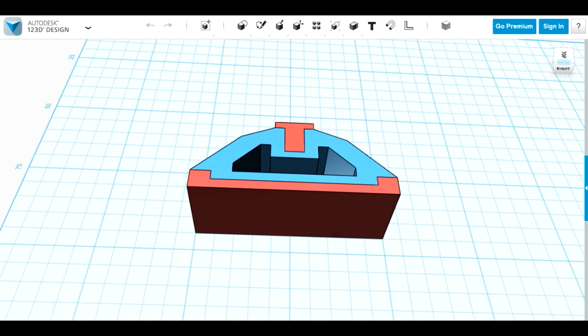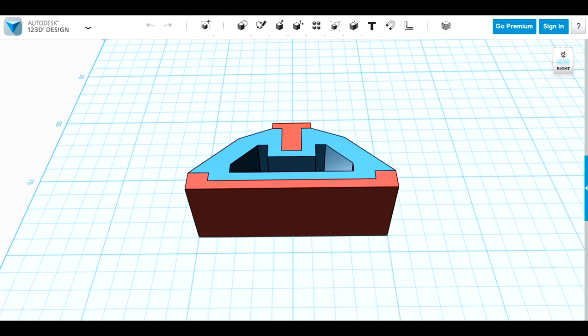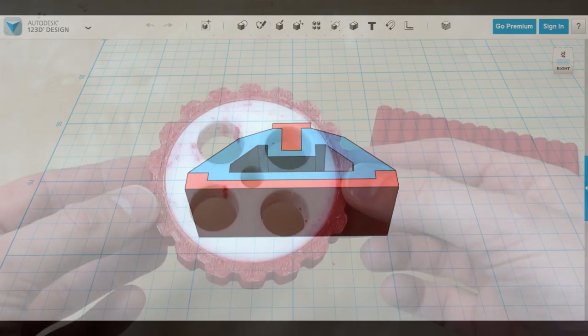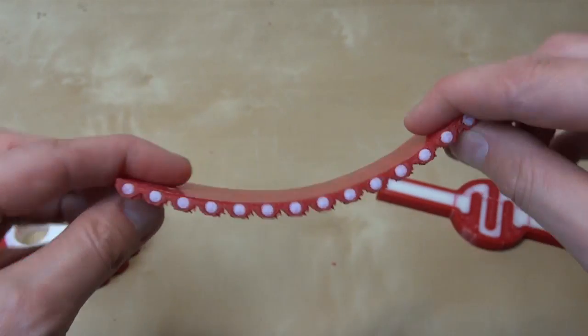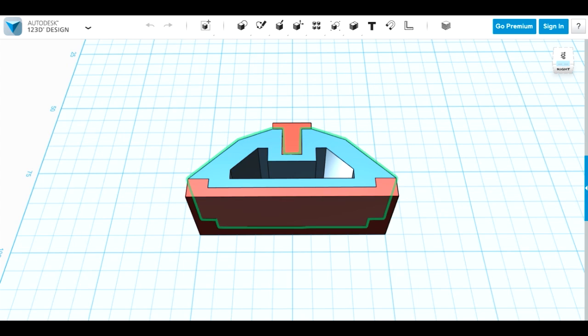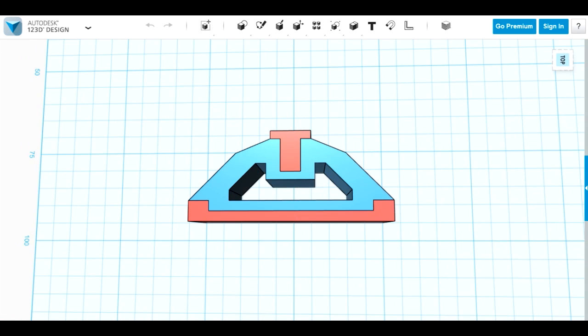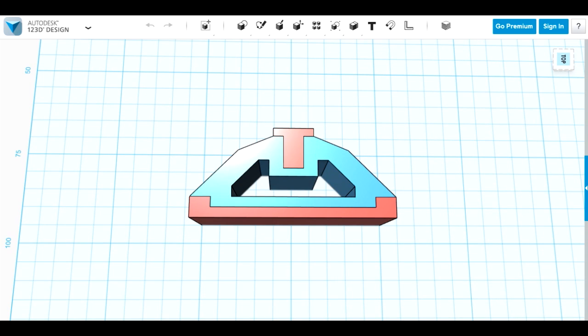Here's a CAD drawing for a piece I'm going to 3D print. My printer is a Lulzbot Taz, a very special Taz because it has dual extruders, meaning I can print in two materials at once. One extruder is specifically for flexible material, so I can print hybrid parts that are part rigid and part rubber. In this design, the blue parts are printed in rubber and the two red parts — the base and the top — are printed in rigid ABS plastic, the same plastic the hip pods are made from.